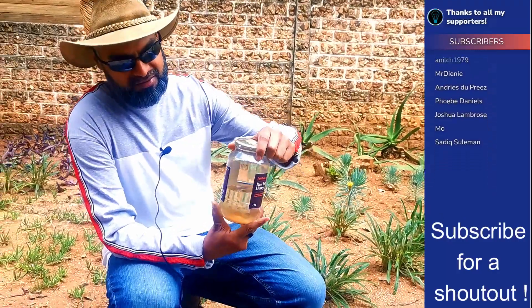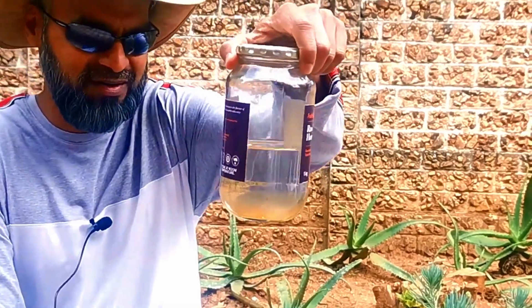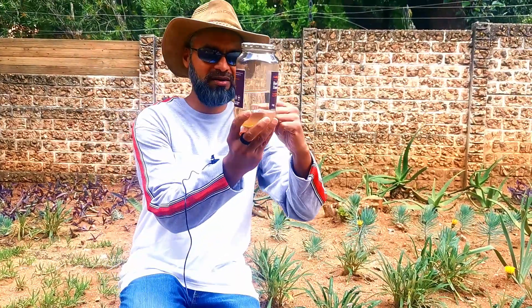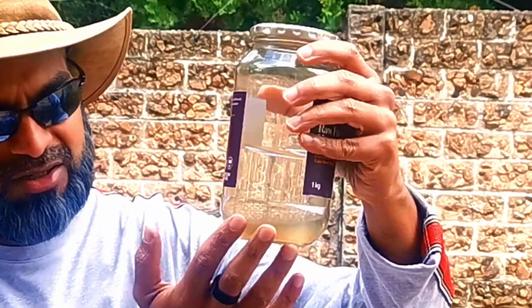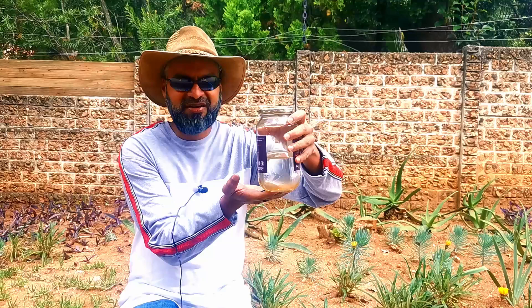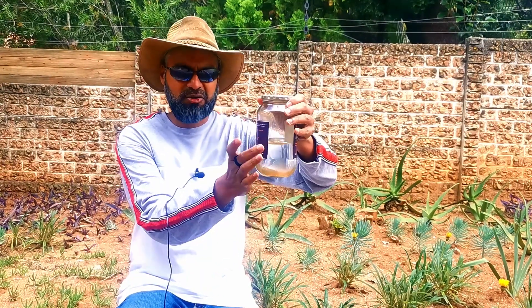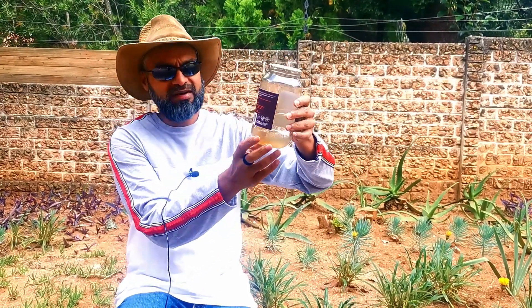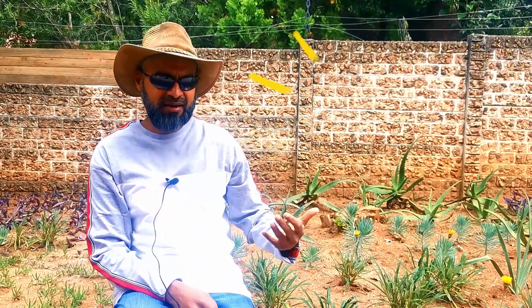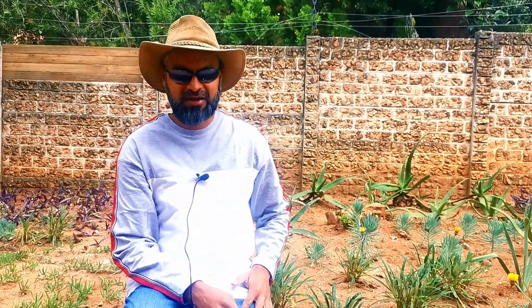This is a sample of water that was extracted from the well shortly after it was drilled. The top part is quite clear, and here you can see this orangish brownish residue. This is actually iron — ferrous, or Fe on the periodic table — and the iron is dissolved, so it's soluble iron. It was dissolved into the water and when it comes into contact with air and sunlight it oxidizes and forms this rust, eventually settling all the way down to the bottom.